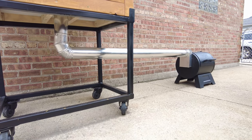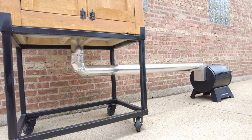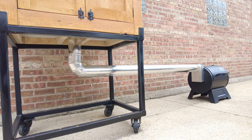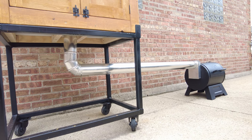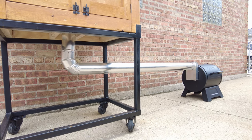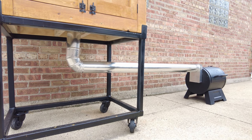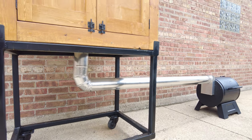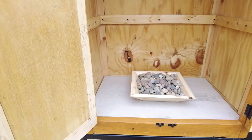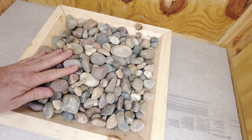The reason I regret the plywood — you can see here it's already bubbled up after a couple days of rain. I was hoping the stain would act as a moisture barrier, but it didn't. The plywood immediately swelled and now I'm going to have to redo these doors at some point. I tied in the firebox with a four-foot piece of aluminum duct and a single elbow going up into the cold smoker, and I used a piece of cement hardy board inside in case it got too hot or there were any sparks.